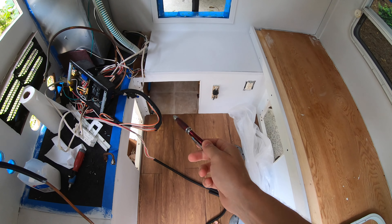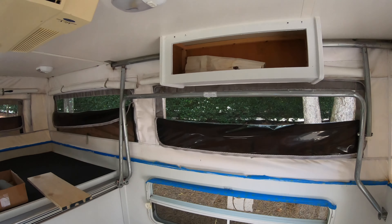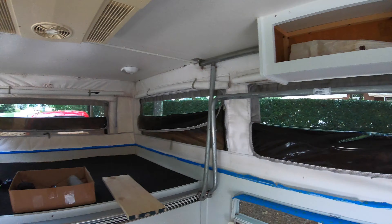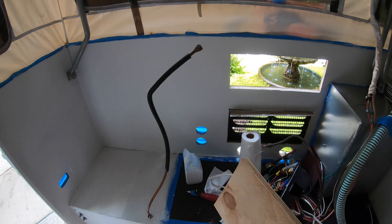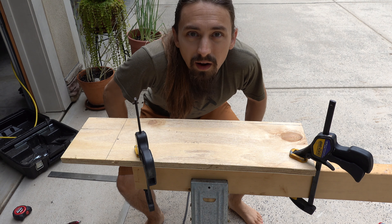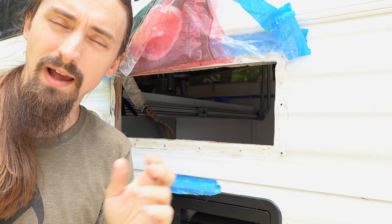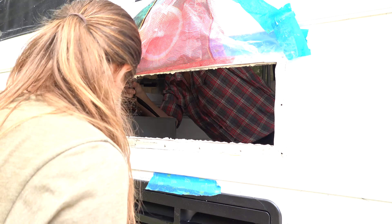Tara has been removing all of the cabinet doors, which are going to get painted possibly a little gray while everything else stays white, so those will be accent points. The upper cabinets will stay — we're not going to paint them because they look pretty decent and will fit the overall theme. Our leftover piece of three-quarter-inch plywood from the repair is just big enough to cut down and fit the hole. I've marked out the dimensions, cut it to size, done a bunch of sanding on the hole to get a good fit, and now I'm going to liquid nail it around the entire perimeter and push it flush to the inside wall.